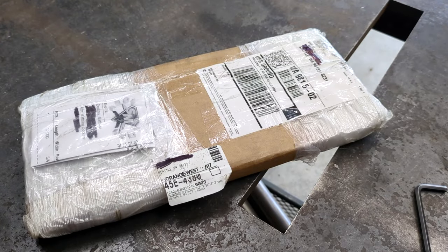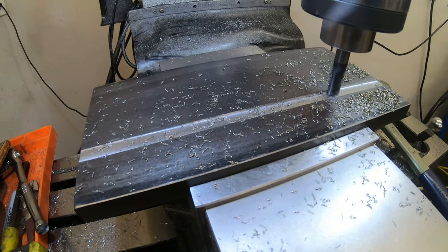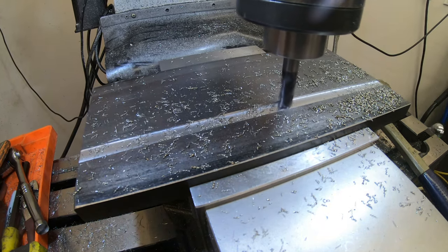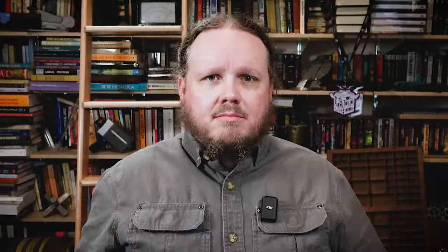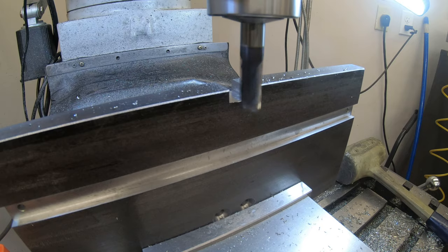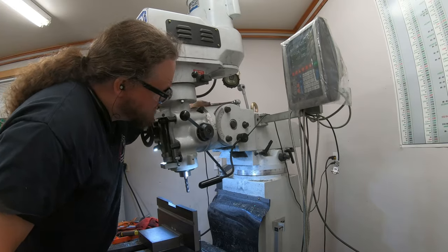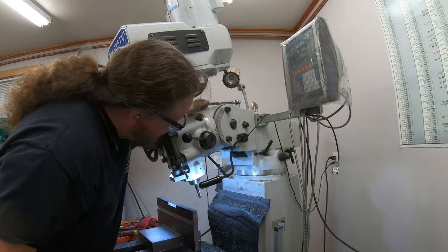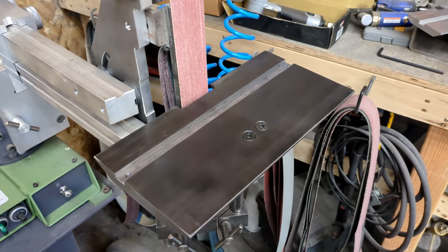Again I turned to 4130, this time being forced to order a custom cut — as you can see, it was going to be a significant upgrade. None of the machining was particularly hard, it just took a while because of the material and how much had to be removed. First was the tool slot along the front edge — I even drilled holes in each end like the original had, though I'm not entirely sure what they're there for. Maybe to add stops so the tool doesn't slide out? They're not threaded though. A little cargo-cult engineering never hurt anyone. Then I drilled and countersunk the mounting holes. Next was the little recess so it can tuck in around the belt, which I cut vertically to get nice crisp right-angle corners. Luckily the piece was thick enough that I didn't get many bad vibrations with it mounted this way.